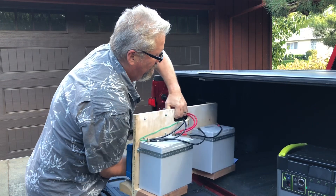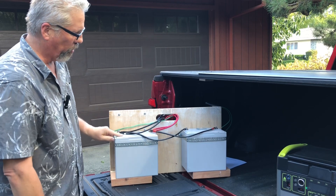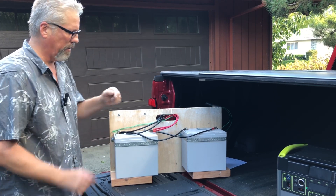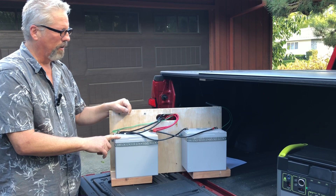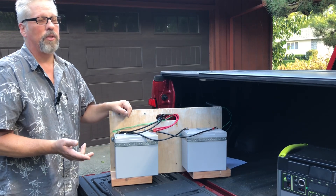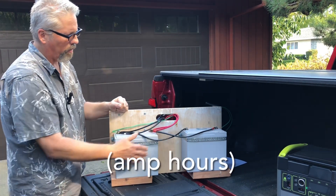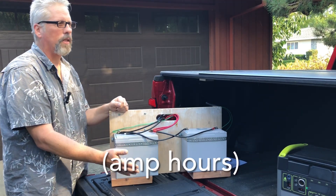On the back I have a battery bank. These are two Fuel Zero 48-volt 13 amp-hour batteries — the cheapest and smallest 48-volt batteries I could find. The cost of these two together was cheaper than the next cheapest option, which was a 48-volt 50 amp-hour battery at around $800. These are paralleled together so it's 48 volts but I double the amps to 26 instead of 13.